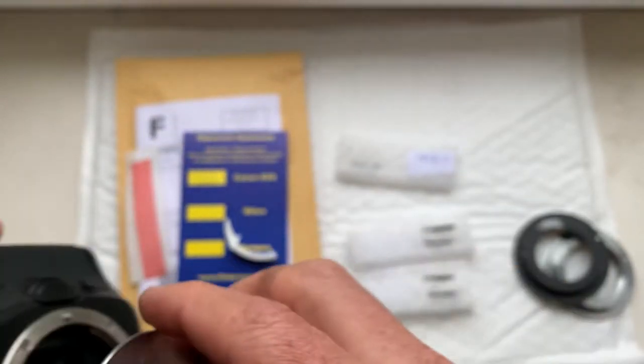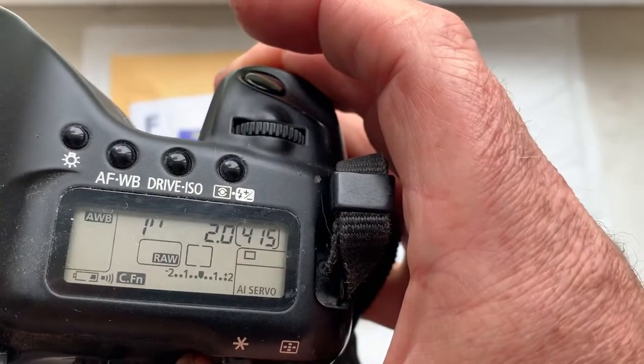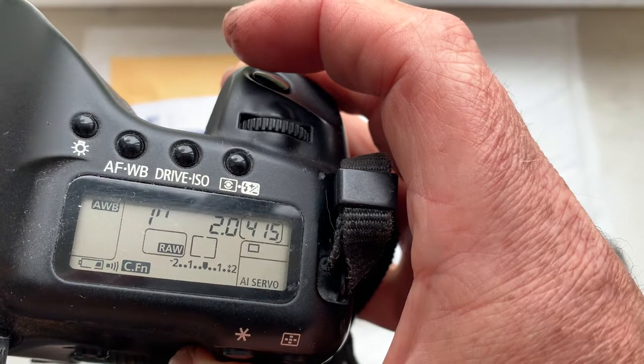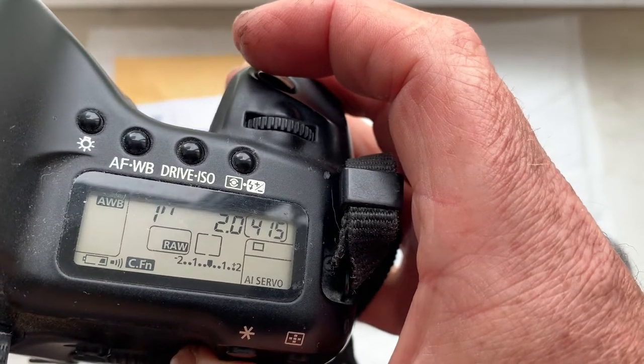And chip number three. This chip is pre-programmed: focal length 135mm, aperture 2.0, delay time to enter programmer mode is one second, focus trap mode is on.